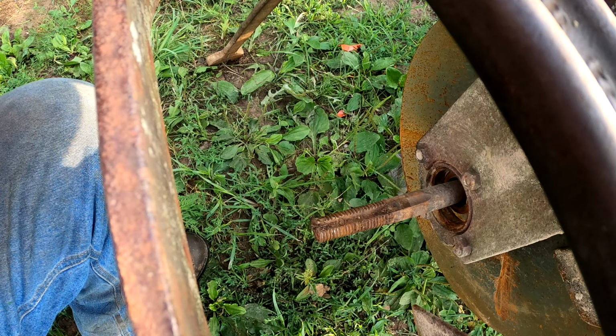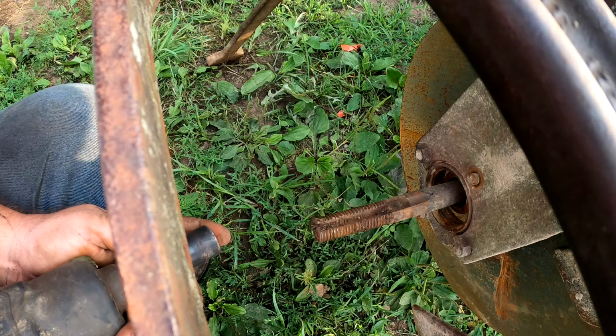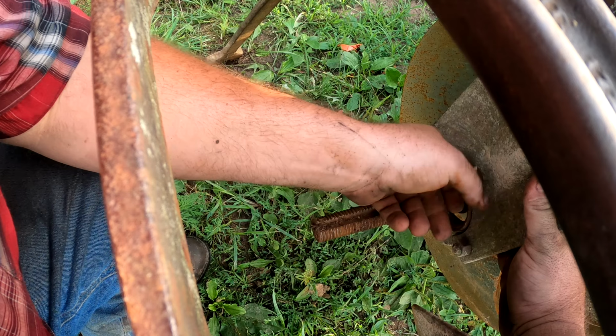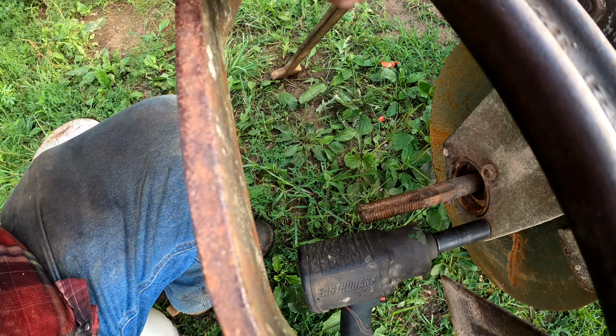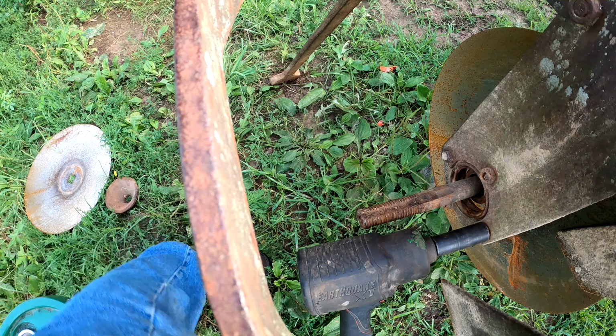We'll see about how easy this is. But I see another problem that's going to happen. I need to just leave that part way on, because I'm going to have to take the upper one loose, because you won't be able to get the bearing on the back side where the flanges are. So, unfortunately, it's more than just three bolts. And I'm going to need more tools, I can see now. I do not have enough, because, hey, why not? Why not need more stuff? I need a wrench to hold those. I need a 15/16 wrench to take the top loose.